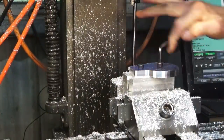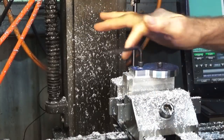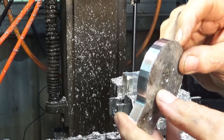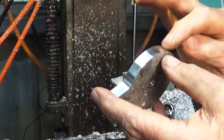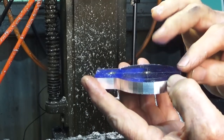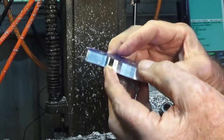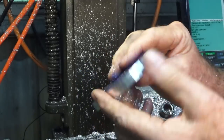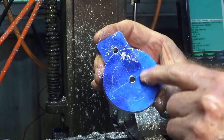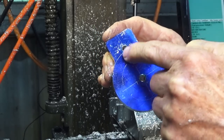Well, you would have heard how scary that was on the roughing pass — this machine has rigidity issues, but we got there. Now clearly I've got some sort of problem going on here. I actually knew this was going to happen when I created the drawing in Autodesk Inventor, then imported it into CorelDRAW and edited the DXF file. As soon as I put it into my CAM software it ended up with those flats on the curve. It looks pretty cool actually, but it will attract criticism, so I'm going to blend that with a file. What we need to do now is go over to the lathe and bore this out to fit the quill on the tailstock, then bore the other hole for decorative effect, and then cut the slot.